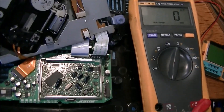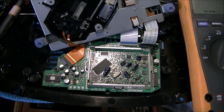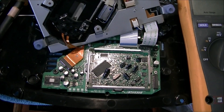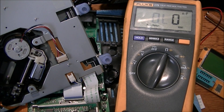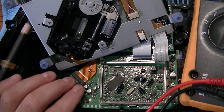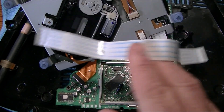I'm going to go back in and recheck the values. I may have to lift one of the legs on some capacitors - something's not jiving in here. I checked all the capacitors before putting them in, something may have gone wrong. I tested this capacitor out of circuit and it's reading normal, so I have to resolder another 47uF 25V. The rest of the capacitors I think are okay.